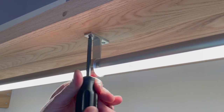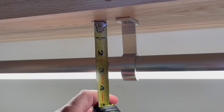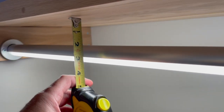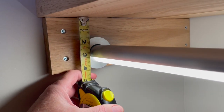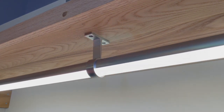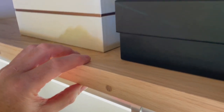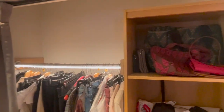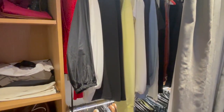The last step is to screw the center bracket to the bottom of the shelf. It's worth noting that the mounting position for the center bracket determines where the collar is going to be screwed to the side support. The need for the center bracket is obvious — the pole itself is really soft. For that reason I also attached a hardwood board to the leading edge of the shelf to stiffen it up. That said, the poles in our other closet are three feet long and are holding up fine.